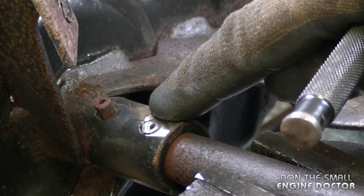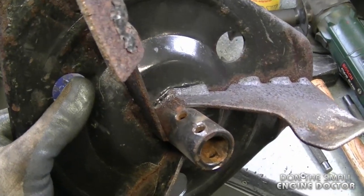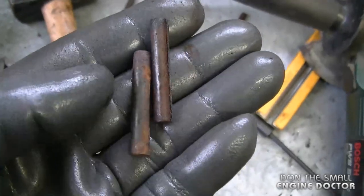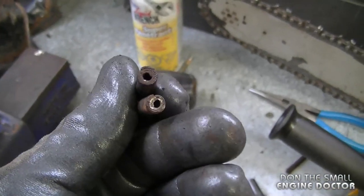Once you cut it like this, you should replace it with a new pin. Just another quick tip: if you're going to reassemble all these parts together, I highly recommend that you use anti-seize on these parts. Also, if the pins are in good condition like this when you remove them, you can reuse them — you would reinstall them the same way using the hammer and the punch.